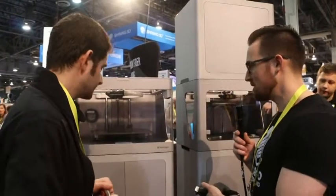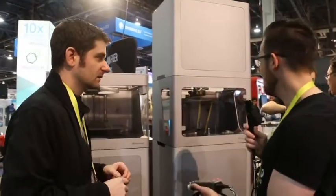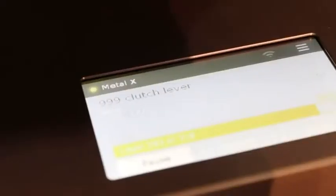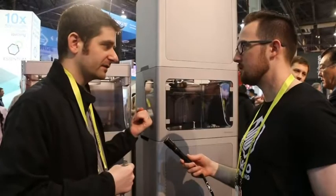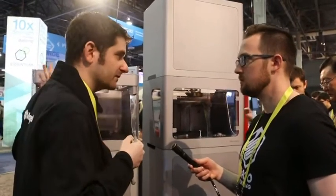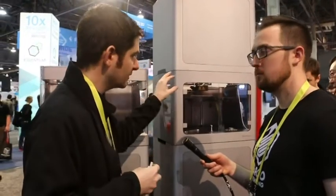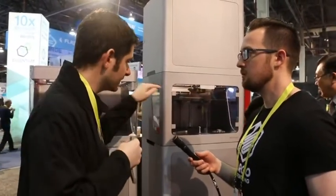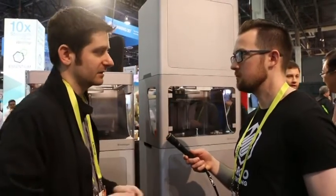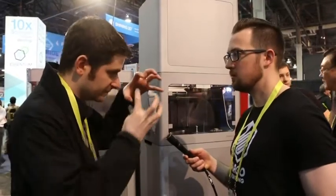That's the Mark X, and this one is definitely very different from the Mark X. This is our new Metal X — we're debuting it new at the show. It's a similar idea to our composite technology, where on the composite you have continuous fiber encased in plastic. Here we have a powder encased in plastic that you melt layer by layer to build your part. When the part is fully built, you take it out and sinter it in an oven where you burn off the plastic and the metal diffusion bonds together. We call it Atomic Diffusion Additive Manufacturing, which describes how the little spheres sinter together.